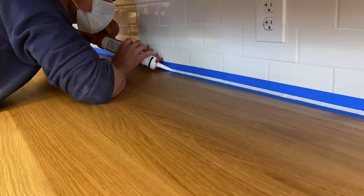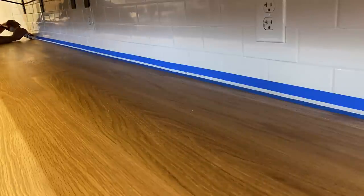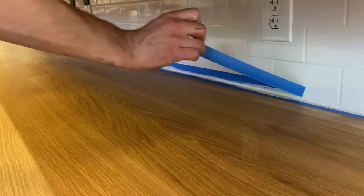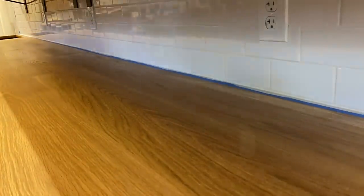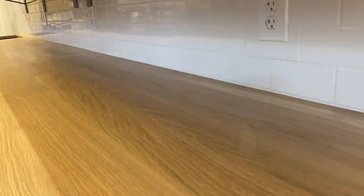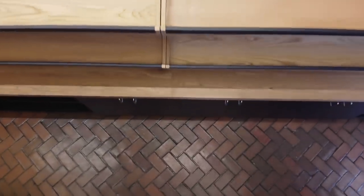As a final tip for wood countertops: apply silicone or caulking to the bottom edge rather than grout, because grout will crack due to lack of flexibility. A color-matched caulk or silicone can move with the countertop and won't crack over time. After that's taken care of, we are done! This project took a lot of time and energy, but it turned out better than I could have imagined. Between the wood grain, the finish, and the beautiful white accent tile — it's a beautiful complement to the space. What a beautiful, sexy beast.